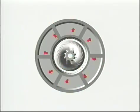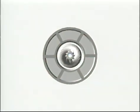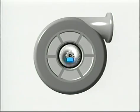As the high-velocity vapor moves radially outward through the diffuser, the flow area increases, slowing the vapor and increasing the pressure. Some diffusers have vanes or pipes which change the flow direction and further slow the vapor. Finally, the volute-shaped casing collects the slow-moving high-pressure vapor from around the diffuser and conveys it to the discharge connection of the compressor.